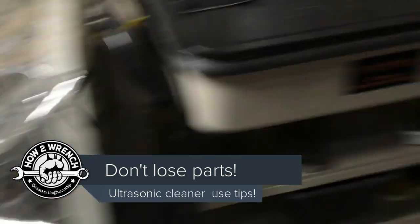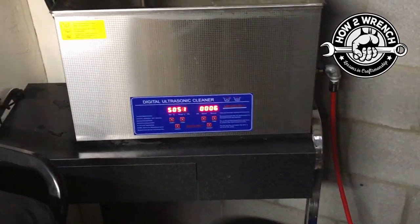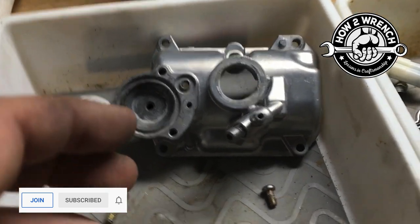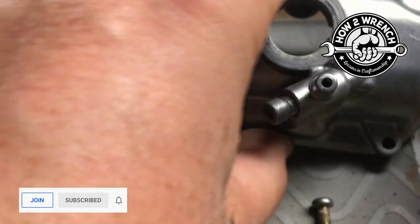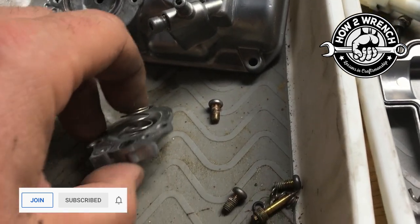We like cranking up the heat on these — and that's Celsius by the way — and it'll still go quite a bit hotter yet. When you get this cranked up, that can allow aluminum to expand so much that anything that's brass could simply just fall out. So you can't just walk away and think you're gonna be good to go.